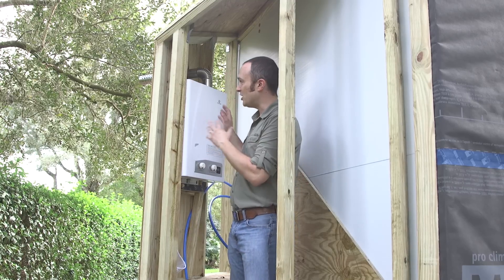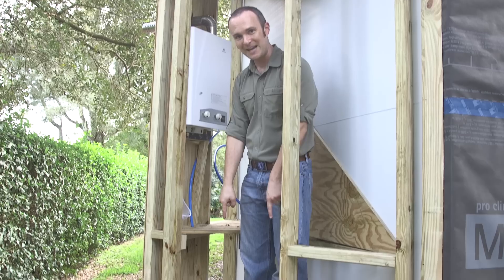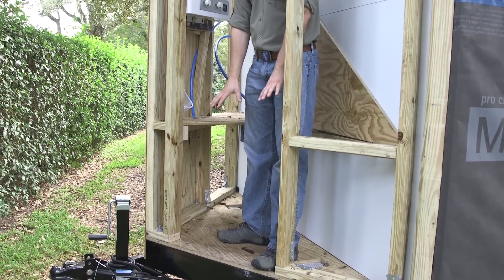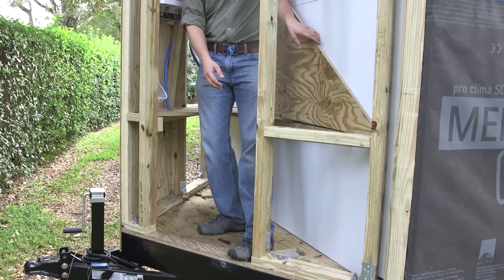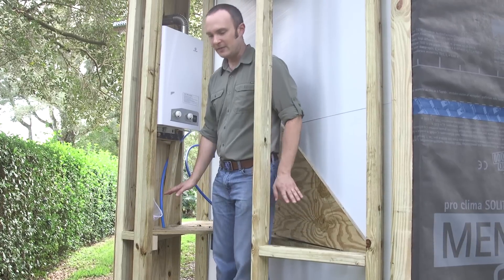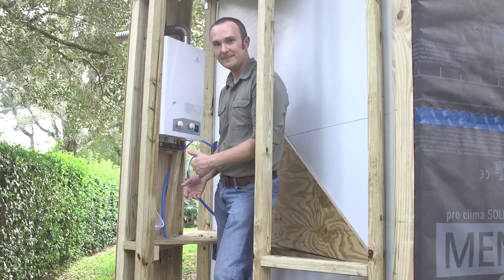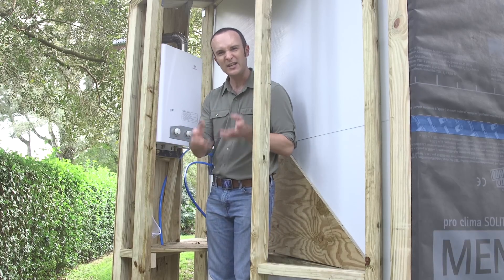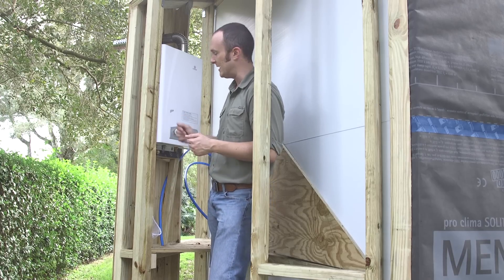Now, because it's in the shed, it's going to use combustion air, but we want to make sure the propane tanks — which are going to be kept down here at my feet and are what's going to be heating the water — are separated air-wise. So we've built this floor, which is going to be relatively airtight to the lower chamber of this front mechanical closet. The propane tanks are vented out through the floor with little vents, so if there's a propane leak, it goes out and down to the road instead of up toward the water heater.